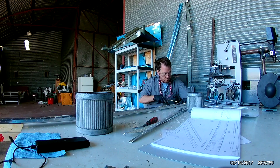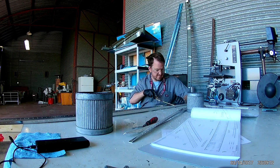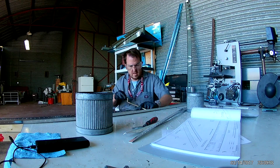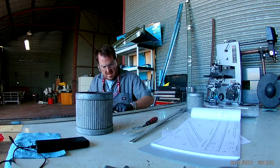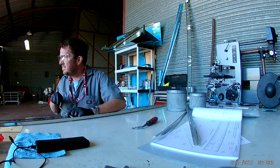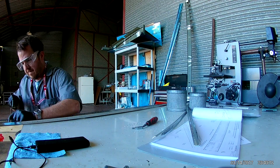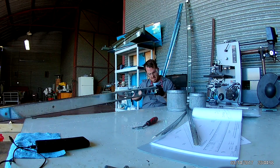You'll see I've got my regular deburring tool. But the deburring tool comes with a nice one-foot extension, which is invaluable for dealing with small cramped spaces. And it comes with a slide that sits over the extension so that you can kind of trap the extension through the slide on top of the other flange so you don't scratch the other flange.